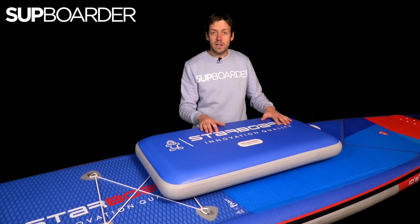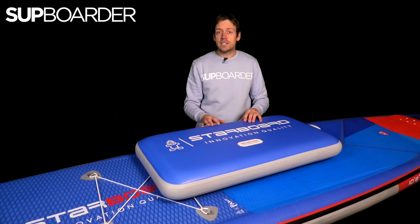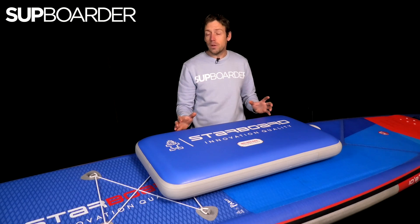If we compare this sample to the full Starboard Icon board below it, you'll see that the Icon has got a lot more rail material on top over the welded rails, which makes it even stiffer and even stronger — but still the first layer that could come into contact with the air, or could fail, has been welded. This is why sometimes when you look at a Starboard board you won't actually see the welded technology on the outside; it's more on the inside. But as soon as welded technology has been applied, that rail will not leak through that welded area — or as Starboard say, it brings that warranty rate extremely low.